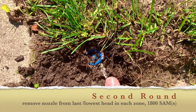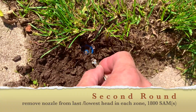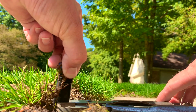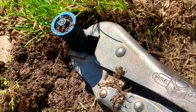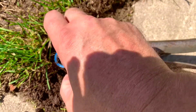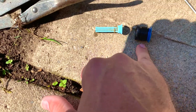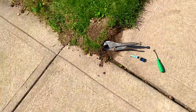Here I'm going to go ahead and pop this sprinkler head up using the tool that you get from Rain Bird. I'm holding the base of the sprinkler head and then we're going to take that cap off. That'll relieve all pressure and any remaining water that has flowed down into the lowest part here will pop right out. It's an inline filter that determines the opening of the spray. We'll go ahead and turn it on in that zone for one minute and clear out any last remaining water.